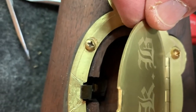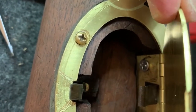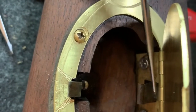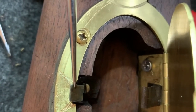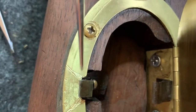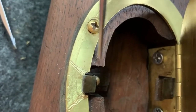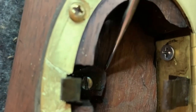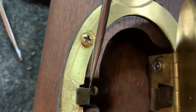And here's the finished box. There's two springs that come with the kit. One is back here installed on the lid plate and pushes the lid up so you can get your fingers on it and open it the rest of the way. The other spring is the latch, which holds the lid down. The latch spring requires that you file a little bit of the outer ring and the lid so it has room to work, and it also needs to sit on higher ground than the bottom of the box, which is dictated by the lid plate.